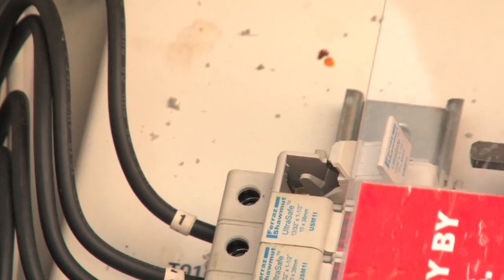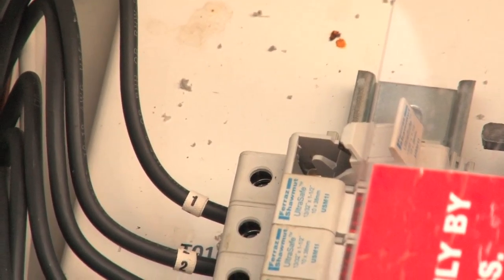Now we had our contractor open up one of the fuses for the ungrounded conductor and remove the fuse. We want to talk about this fuse. The fuse we have here is a 15-amp rated, 600-volt, DC-rated fuse. That's really important. Commonly, what you'll find is there are a lot of fuses out there that don't have a 600-volt rating, or if they do, it's not a DC rating. So it's very important that you inspect these fuses and know that it matches the plans and specs. This 15-amp rating was determined as part of the design and referred to in the drawing set, so we know it matches our plans and specs as previously approved.